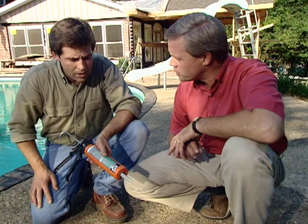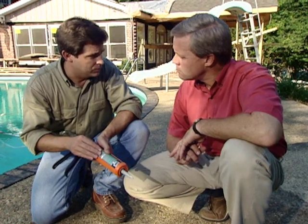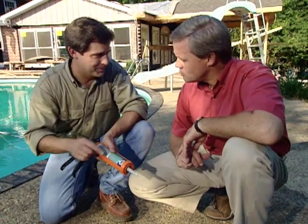Now what about the type of material that you're using there? That's not just regular caulking. No, this is formulated specifically for concrete. It lasts very long, for one thing. It also protects against the water, the ice. One thing I like about it, it cleans up with water. Good. It's silicone-based, so you get those expansion properties to be able to continue to expand and contract.